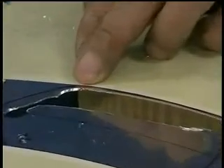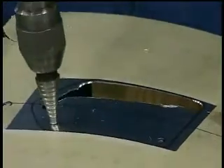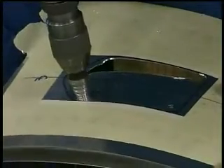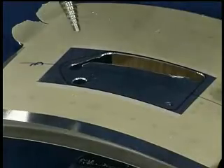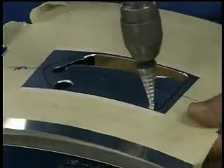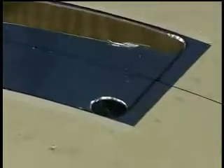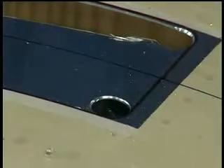I've got a fair bit of filing to do on one side and very little on the other — that will have to be finished off with a hand file right down to the line, or halfway through the line, to get it as accurate as you can. I'm going to continue drilling the last two holes. Stop every once in a while and check how close you're coming to the line. Cutting right on the line minimizes time spent filing.